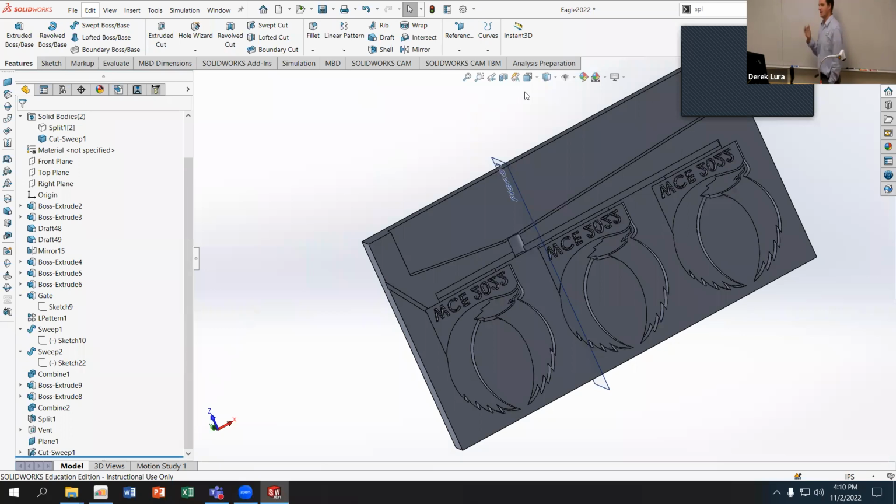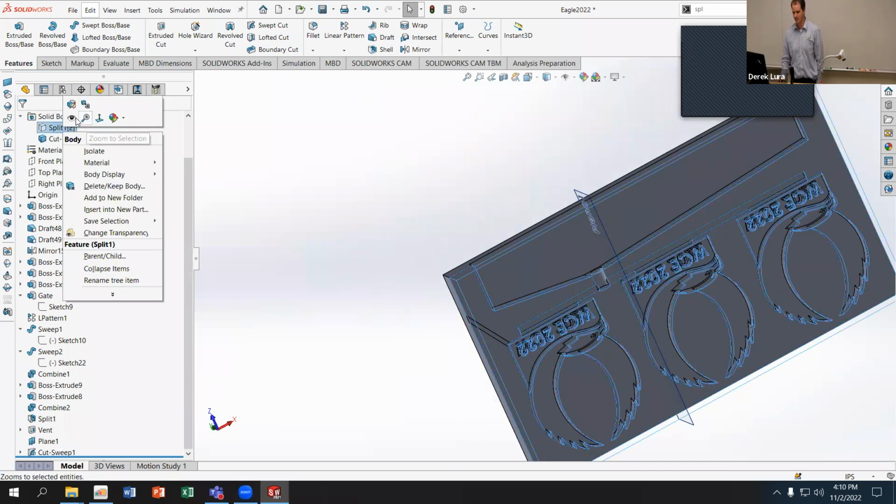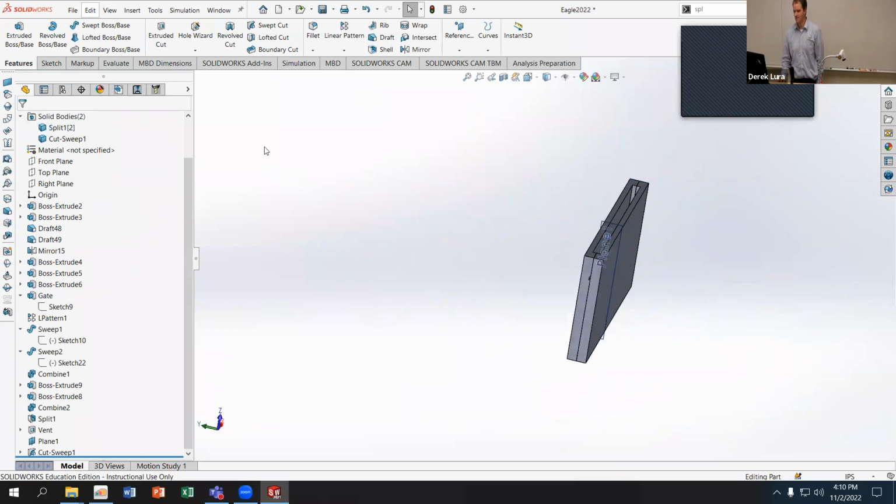And most of the time, they're going to be able to come out. The last thing that you want to include in your mold is usually some kind of locating features for both halves of the mold. In this case, you could say that the locating features are the mold itself, and that the edges of the mold just line up square, and that's what I'm using to locate them. But more often than not, you want some kind of intentionally designed locating feature that's going to help the alignment of those parts as you've made them. And so with that, you typically want to add some kind of peg and some kind of slot or hole inside the components. So if I'm going to do that, again, I'm going to hide this outer portion first.